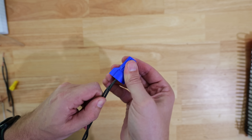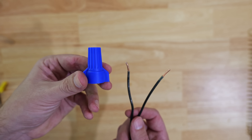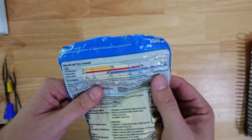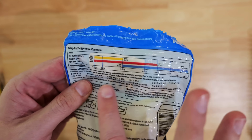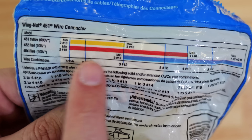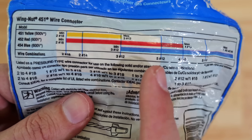The minimum size that can go in this blue wire nut is 12 gauge wire, but with a minimum of at least three wires. It's incredibly easy to know what your wire nut is capable of — almost on every single package of wire nuts you can buy in the store, they're going to have a bar graph on the back or side that lists exactly what size of wire will fit in that particular color and kind of wire nut, the quantities of that size, and the minimums and maximums.